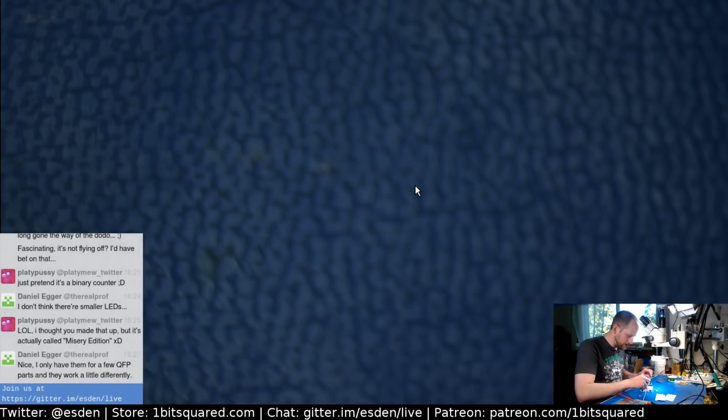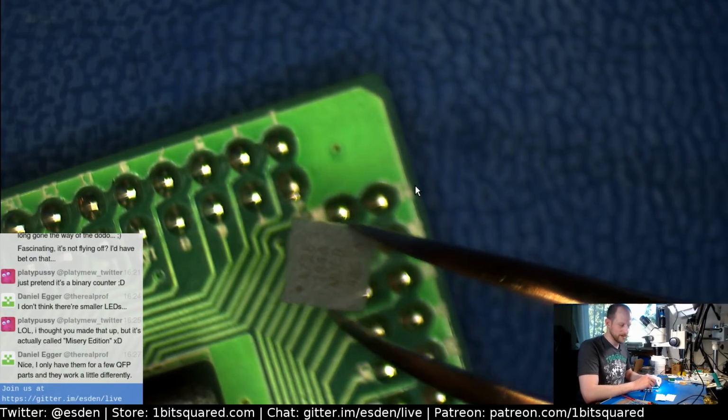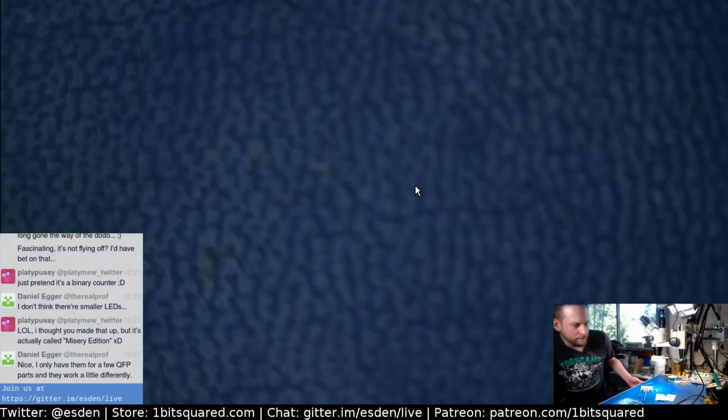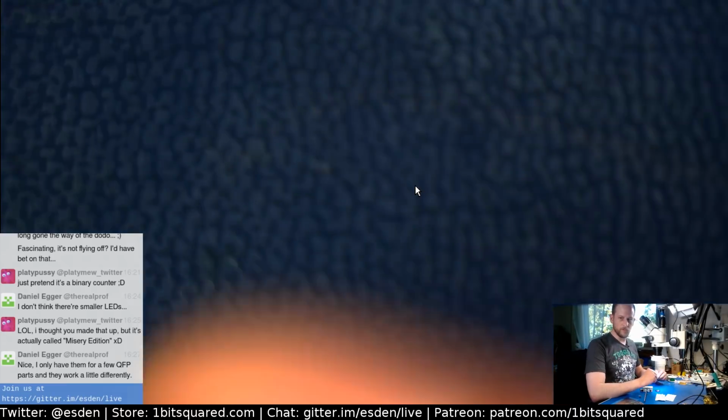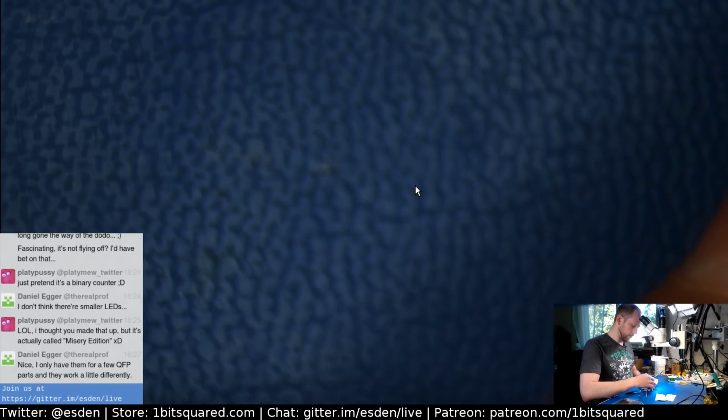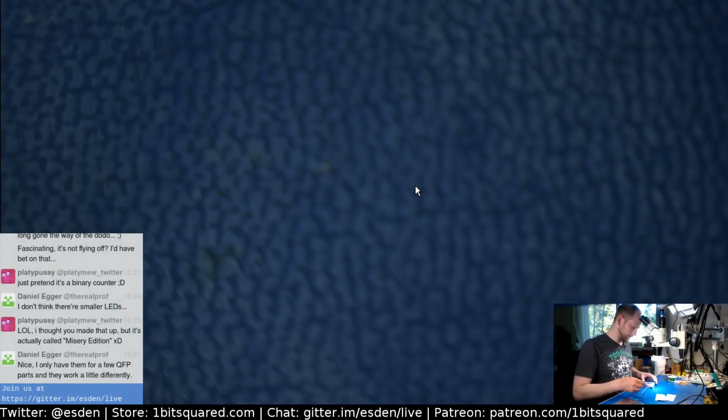And similar parts are being used. So this is that ATtiny, it's so much smaller. When they are pre-programming some parts for you before production, I think it is a much more automated process where you use a special pick and place machine that can put it into the jig, program the part, and put it on a reel directly or into a tray. I've seen some videos of machines used for re-reeling parts, taking from a tray into a reel or from a reel into a tray. These are very compact, special purpose pick and place machines that can sort this stuff, and they are very, very fast. So that's why it doesn't cost that much to get parts pre-programmed or re-reeled or put in trays, depending on what you need. Because sometimes they come in reels, you need them in trays, and vice versa. So yeah, there you go.